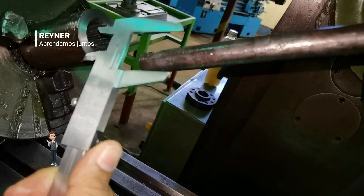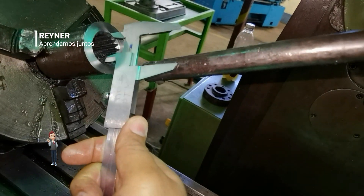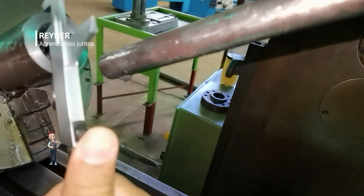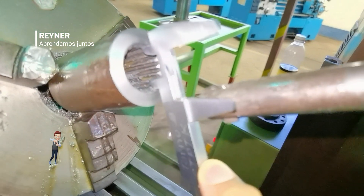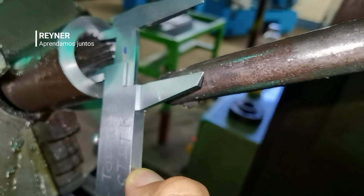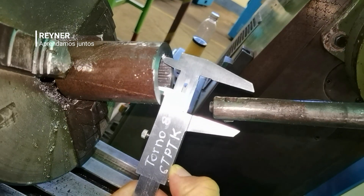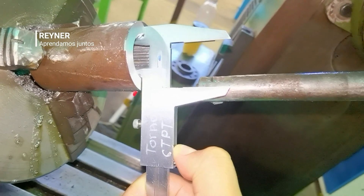I apologize to those watching the video, but it is a reality. So when we are measuring, in this case these are 19 divisions, we have to try to measure the striated teeth that are opposite. If I take one striated tooth from the top and this one over here — there, evidently we can see that they are not opposite; it has to be the opposite one in order to measure the tooth height, which in this case is measured from root to root. Also when measuring, verify that the caliper is not crossed, to avoid parallax error.